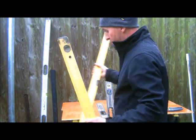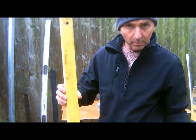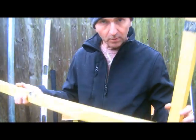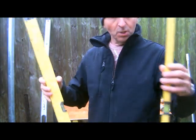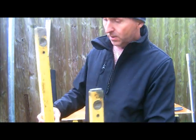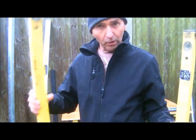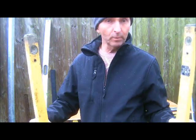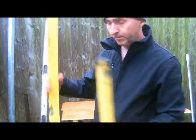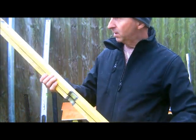These are previous levels I used for a while until I wasn't happy with the bubble, so I bought a new one — but I never throw the old ones away. I use them for floor screeds as straight edges, and in a lot of the running-in videos you'll see these used at either end. If you clamp them up they save a lot of time — rather than building small corners you can clamp them up, mark your gauge on and away you go. So don't ever throw your old levels away; they come in really useful.